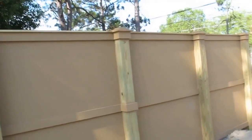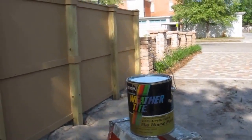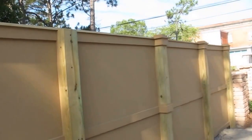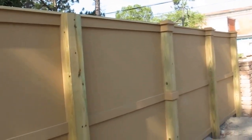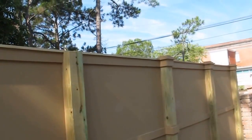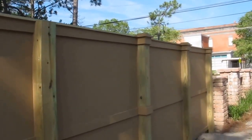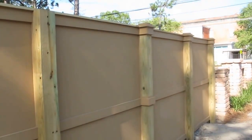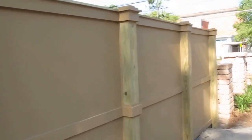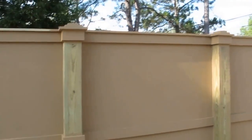I've got a good finish coat on it. This is WeatherTight 100% acrylic paint, which is what's necessary to paint this with. You also don't want to paint pressure treated lumber with enamel paint, and it takes 30 days for pressure treated lumber to reach the point where you can paint it. That's why just the concrete board is painted right now — we're trying to seal it and keep any moisture out.